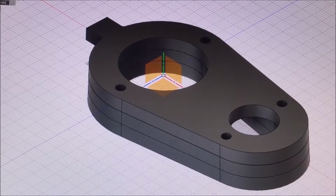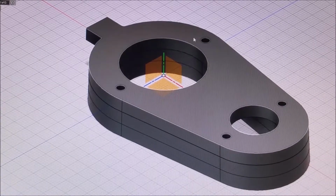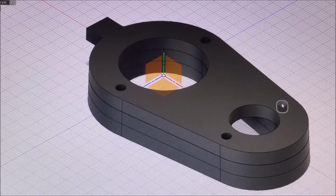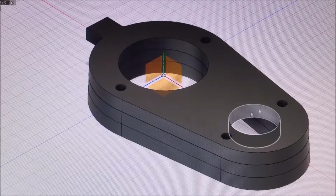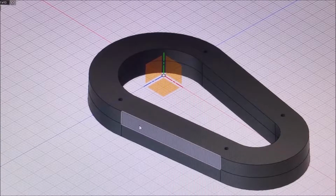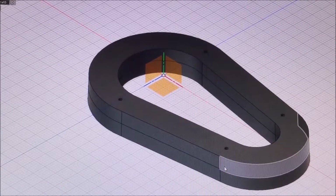So this is what I have lined up in Fusion 360 for this dust shoe. This is the top. I've pretty much drawn everything upside down so I don't have to flip anything. These are the magnet holes. This is the spindle and the vacuum cleaner hole. This is a spacer, which you can add one or more, however many you need.